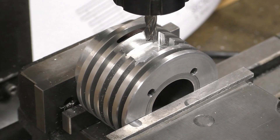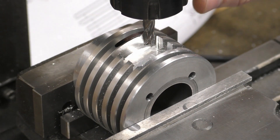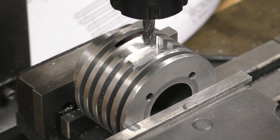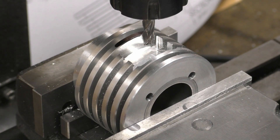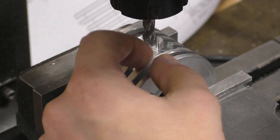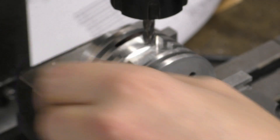The camera died — had to go and fish my other battery out. But yeah, we'll clean this pocket out; you can see that lovely jubbly. So now, without taking it out to deburr or anything like that, because we know our centres, we can basically just poke a hole straight through this bad boy. I've set it on zero and zero — my dials from this edge and from the middle like we did before, off the settings we already had. With this 7mm end mill, I'm just going to punch all the way through.